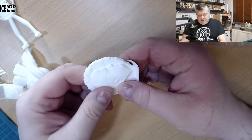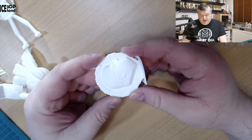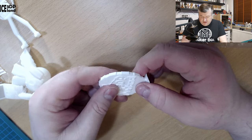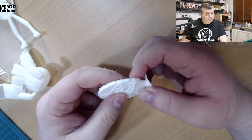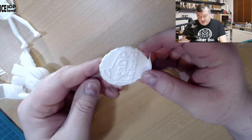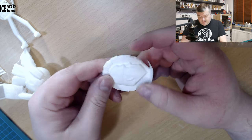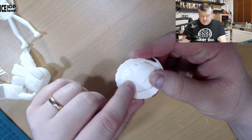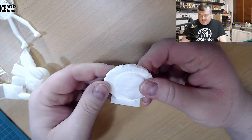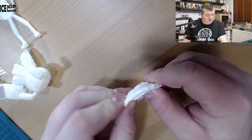I then printed at the highest listed temperature of 250°C. I got this MakerCoin printing and it looks pretty good — it was printed with a 0.2 extrusion multiplier setting. The overhangs came out pretty good, though there is one line running through the print. But it's really lightweight and fluffy because there's very little material in it.